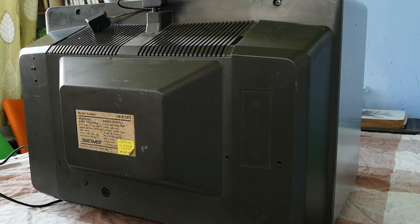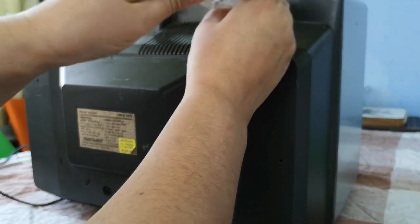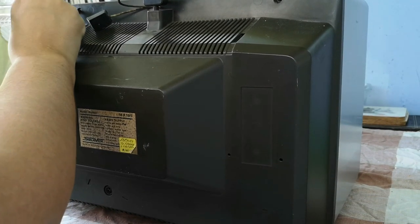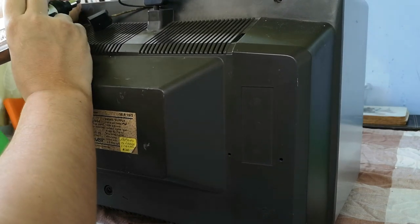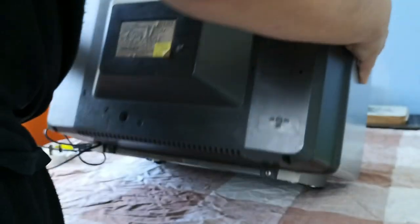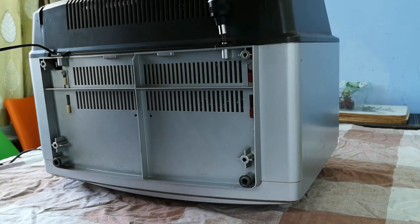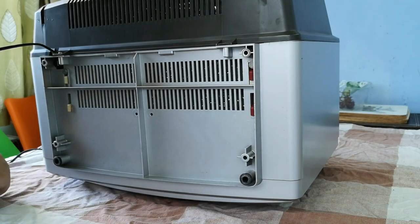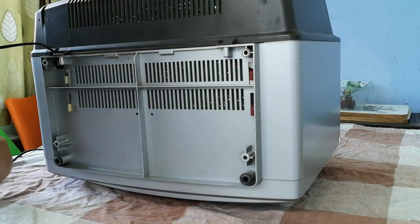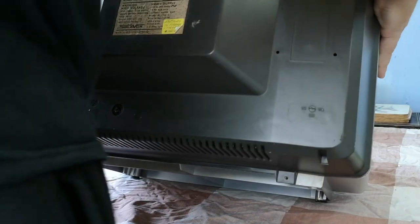The symptoms of the problems with this set, which I took a look at yesterday and I think I've managed to diagnose: there was a rather nasty popping sound coming from the tube. I found that the G2 control was way up - very very high. Lowering the preset did seem to reduce the amount of popping to nothing - there's no popping at all, so that has resolved that particular problem. The other problem is there's no synchronization on either horizontal or vertical; the field hasn't collapsed, and you can still adjust the width pot and the height pot to give width and height adjustment, but there's no synchronization.